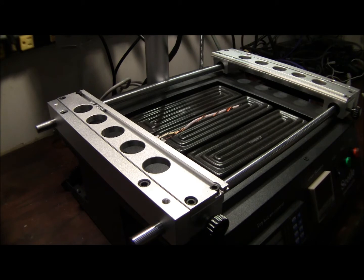At Spitfire Mods, our profiles are designed around a machine configuration we call 'flatline.' We take any rework station out there — whether it has an IR bottom, ceramic plate bottom, hot air bottom, or any upper heater or third zone — and we want to flatline that system to make it fit the profiling mold so that it's compatible with all other systems.